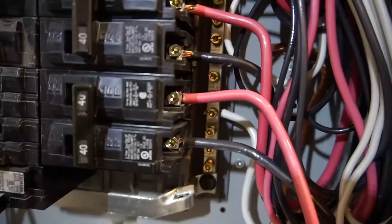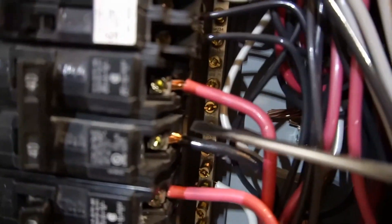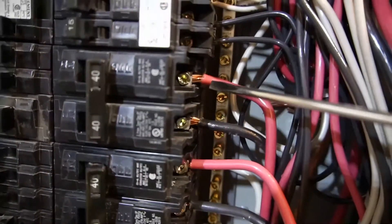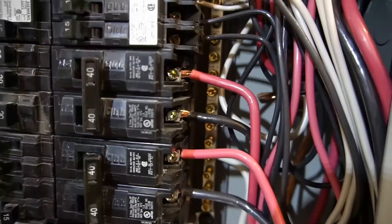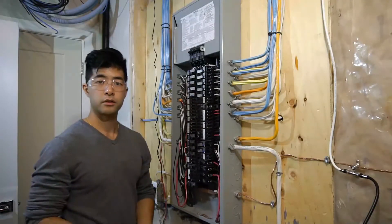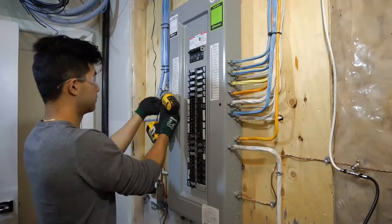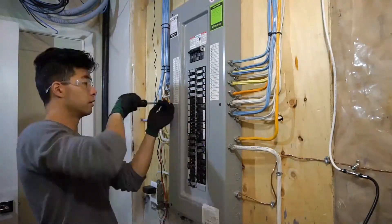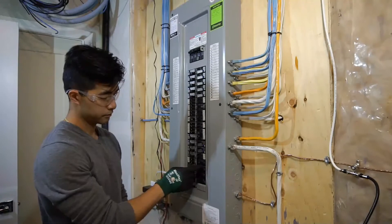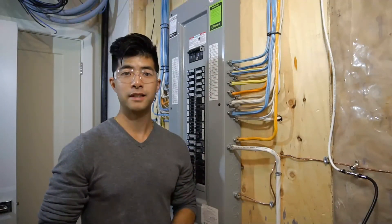This is how it should look when you strip wires and install them properly — there is little to no copper showing. These two are good. But for here, someone else did this and stripped the wires a little too long, so there's more copper showing than there should be, which can be dangerous. So don't do it that way — do it the correct way. Strip it about 1 cm. Don't turn on the breaker just yet. Let's put on the panel first. Once you have safely secured the panel on, we can turn on the breaker. And that's how you install a double pole breaker with a new circuit. Thank you for watching this video.